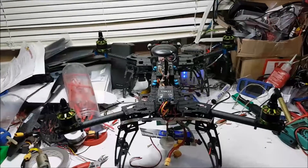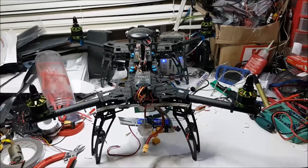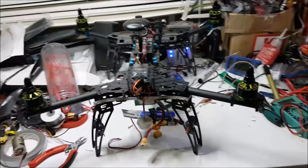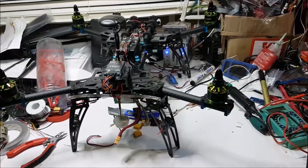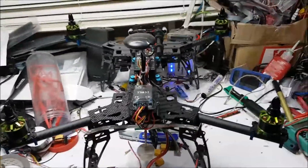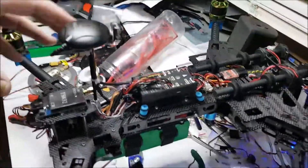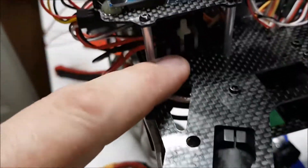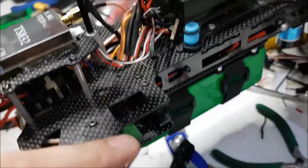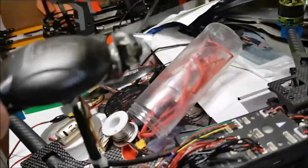Moving along with my upgrade — I've had a couple of issues but that's to be expected. I've pretty much got everything mounted now. I had an issue with center of gravity and the weight. It took me a while to figure out because I've moved as much of the weight as I can from the front to the back. I put my transmitter up the back here and put in a little 7812 voltage regulator because I run a 4S battery, so that gives me a clean 12 volts for the transmitter and the little extra camera. I put on my camera switch.